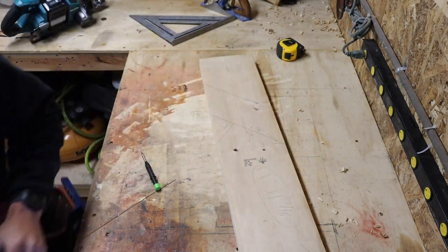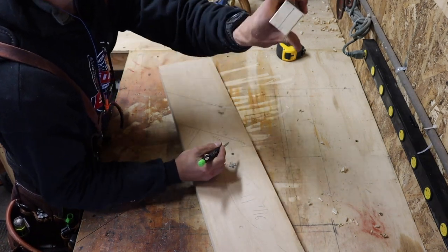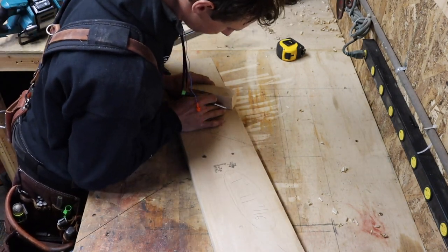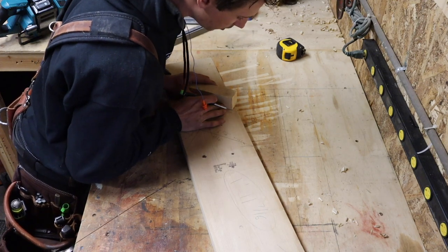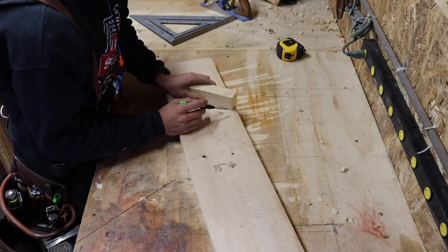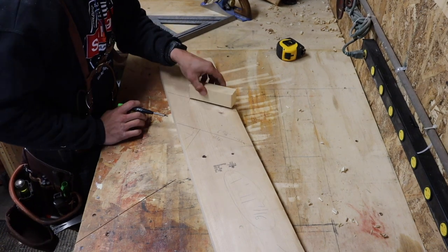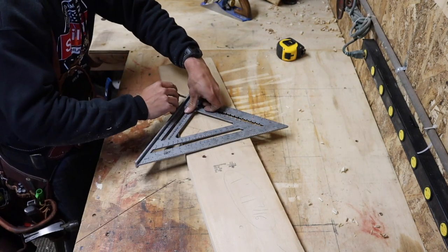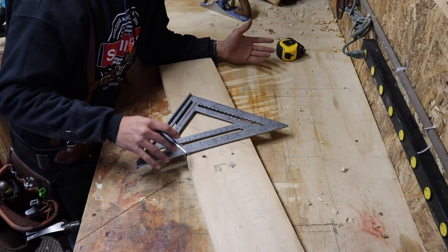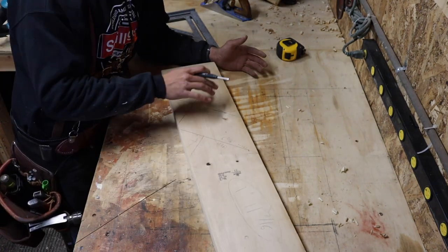But I'm going to go one step further. Here's my center of my fascia — it's 3 quarters. I'm going to put it on here on the line until my center meets that board. Once that center meets that board, that's my fascia height. So that's where I need to square this off and cut it. Put our square on there, and if you haven't noticed, this all makes 90-degree angles. So this is the tail, this is my bird's mouth, and I've got my ridge cut already. Let's cut this and that's our rafter pattern.